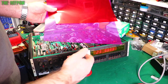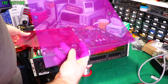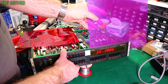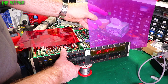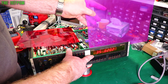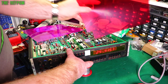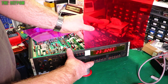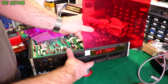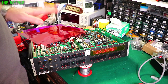So I'm playing around with these films, just trying different ones. The red one and this purple one do the best effects for filtering out the background of the display — the actual faces of the digits. The purple one does quite a nice job; it really hides the background really well, but it does take a lot of brightness off the digits as well. You can see how much clearer that gets just by doing that. And if I do the red one instead, it helps slightly — the digits stay basically the same brightness, very little change on the segments. But the background is still very visible. So I'm kind of torn between which one I'd use.